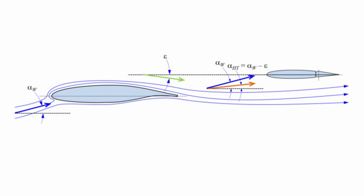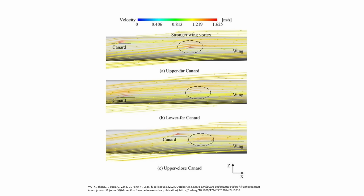Now that we know the main design parameters that we need to pay attention to when laying out and sizing canards, we need to know where we can place them. Remember how important tail placement is when doing initial tail sizing calcs for a normal aircraft? The same importance applies here. And because canards are destabilizing surfaces, the canard effects end up being very sensitive to the vertical and horizontal positioning of the canard relative to the wing.